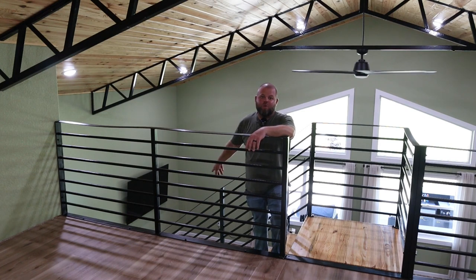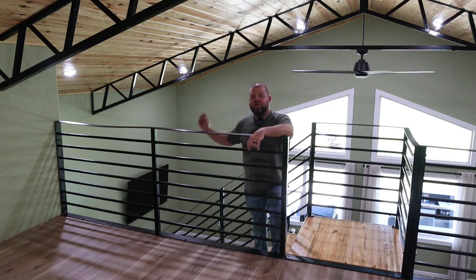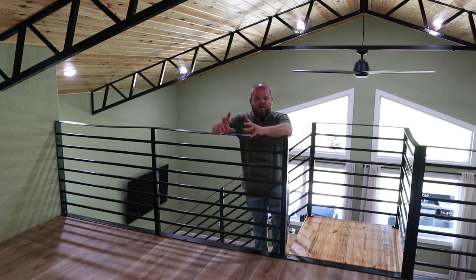I eventually had to walk away from this railing going down the stairs. You have so many odd angles there, and so much stuff changes as you weld. Things heat and expand, then they cool down and shrink, and I literally had to cut sections of this railing out 2 to 3 different times, rebuild certain parts just to try to get it all to bolt together. I still have some gaps and a few little pieces to work out, maybe make a trim piece or two, but at this point, I'm done with the metalwork. I'm not going to fight it anymore.